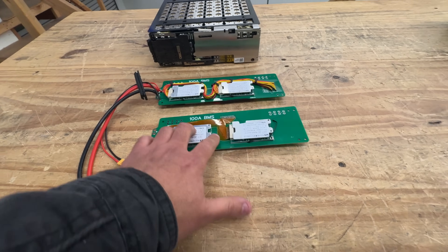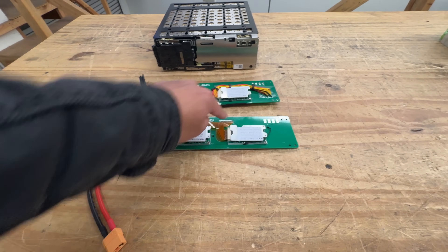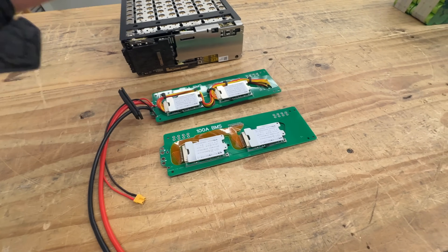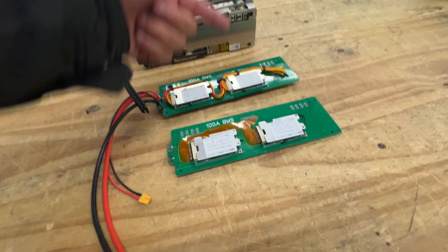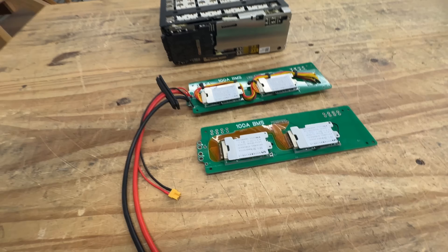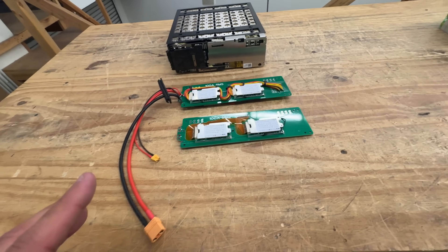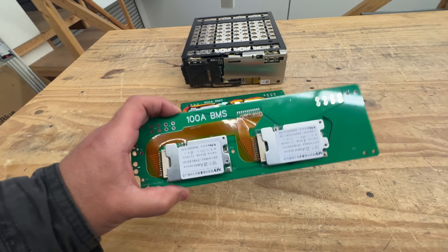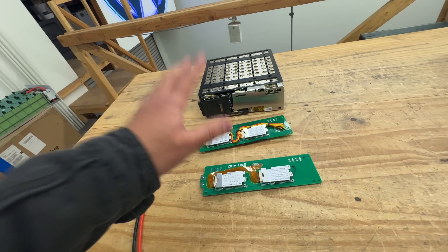The goal is to build this in a way that doesn't cost a lot and is easy for my staff to assemble. The old version might take an hour to build from start to finish; this version might take just 10 minutes. The flex PCB costs a bit more — maybe five dollars extra — but when you factor in the labor savings, it's actually cheaper overall. Instead of a $150 custom BMS solution for this battery, you're looking at something closer to $50.